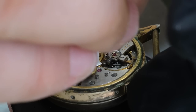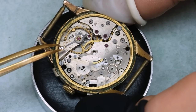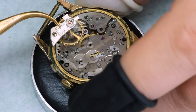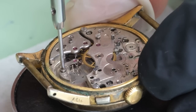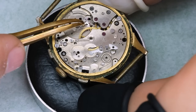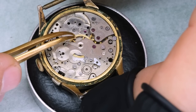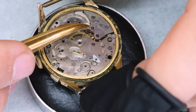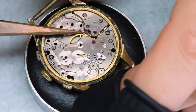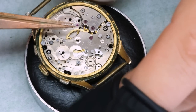We're going to use a special tool to pull up the driving wheel for the chronograph. One of the reasons we can say this is an old movement is that it has a Breguet hairspring — an overcoil on the balance spring. That's something that only the first few years of production used, so most likely this movement was produced in the late 40s or early 50s. There's not a lot of extra play, which is good to see.